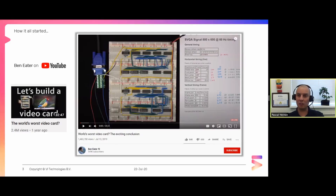The whole idea started with a YouTube video released by Ben Eater. He builds a video card using only a breadboard, some ICs, a crystal, and an EEPROM. He uses the EEPROM to store an image, the crystal for the clock, and the ICs to generate the VGA signal. I saw that video and was instantly inspired to do it on FPGA. You can Google Ben Eater or find the link in the description. He continues and builds a whole CPU on a breadboard, and after seeing this I could instantly see how to port it to LabVIEW FPGA.